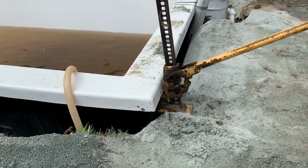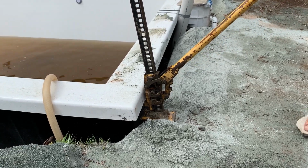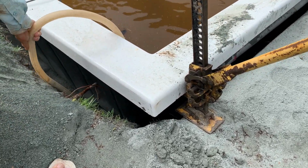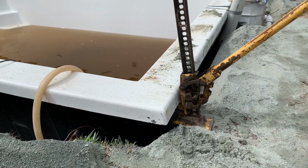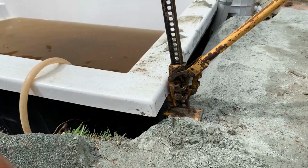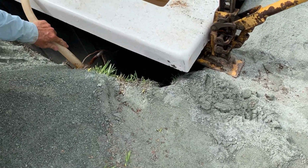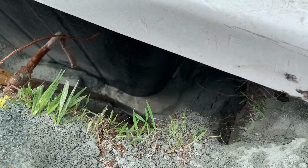You definitely don't want to lift it past the height, because once you do that, it's very difficult to try and lower the pool. And as we touched on before, really this stage is one of the most important parts, because once you get the level of the pool right at this stage and then you've washed in backfill up to that 300 mil depth of water around the pool, you've pretty much locked in the height of the pool. And when you start adding in extra water, another 5, 10, 15,000 litres or 15,000 kilos of weight, the pool level then shouldn't shift. So by the time you finish this stage, the level where the pool is really where you want the pool to stay for the next 20 or 30 years.